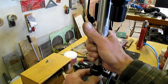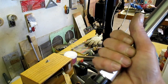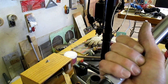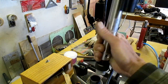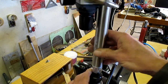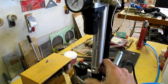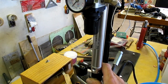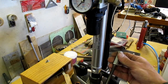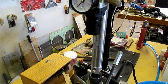You can see it's right at the top there. I did take a little material off this hi-car washer on the lathe — it was extremely tight, so I jigged it up and took a few thousandths off at a time until it fit nice and snug, not jam-hard. This should alleviate the air pockets I was getting at the bottom, because bleeding those out was a major nuisance. Pretty soon I'm going to get the lead pot out and start casting, so I just want to get this ready for when my bullets are cast up. That's it for now, guys — see you later.